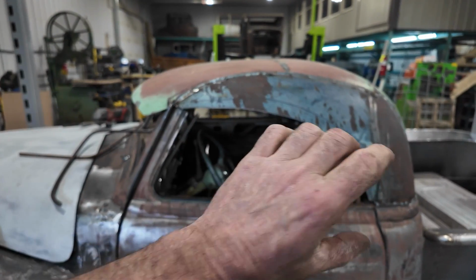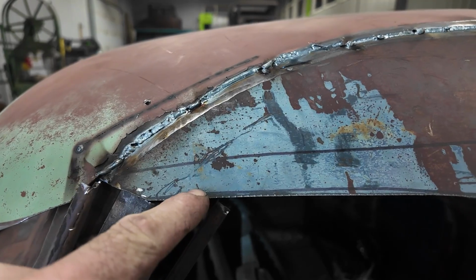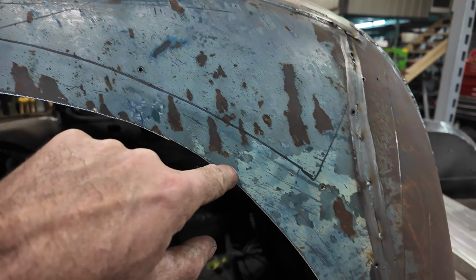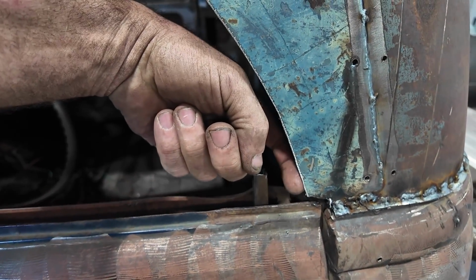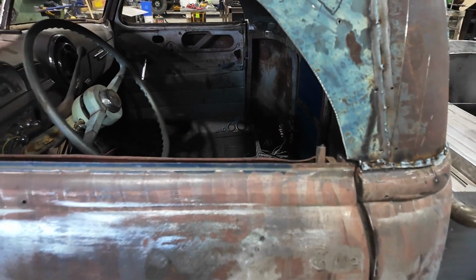I think for the initial into here, I'm just going to bend some sheet metal. I'll do a measurement, see what I get. And then we're going to come up, I don't know what I figure, about half an inch up. Not even that, like 1/4 inch, 1/8 of an inch. It's going to go above this, and I just want to stretch and shrink it till it follows this and comes down just behind the door here. So when this door closes, I guess this top is going to hang over the whole works here a little more than I thought it should, but it'll work for the glass, so we're going to do it. It is the plan.